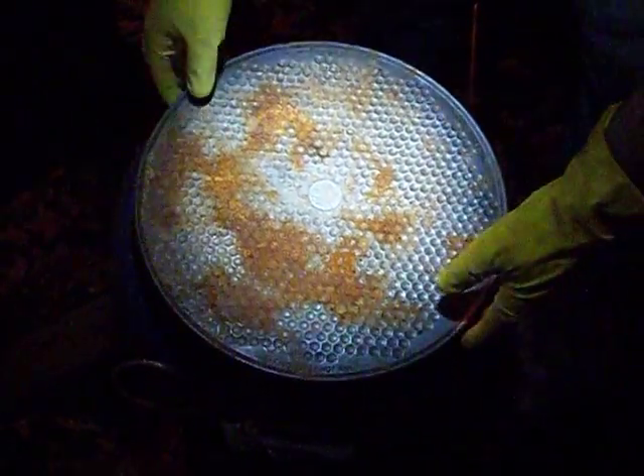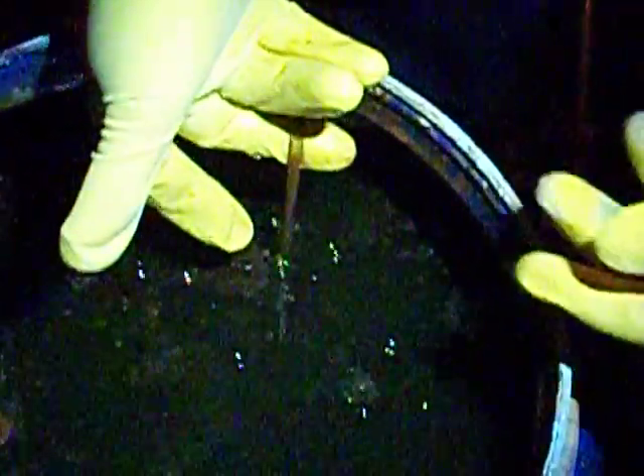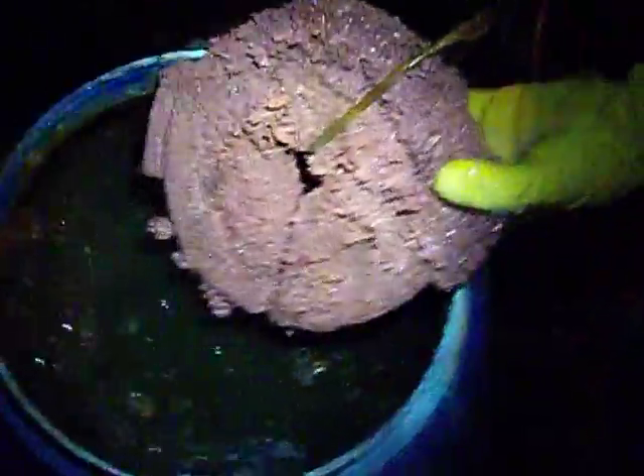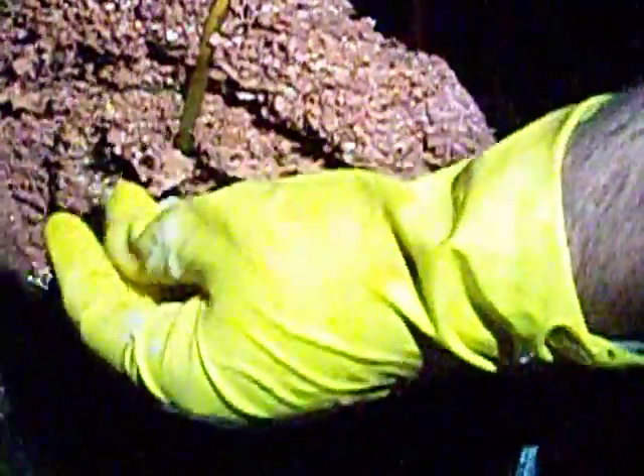This is one of my settling tanks — a small settling tank I use to cement the copper out of old AP solution. You'll notice the color of the liquid is still green tinted, but it doesn't have a lot of copper in it because I've got these pieces of tubing here I use to hang weights. These weights collect the copper — it's just an old barbell weight, steel — and it collects nice copper crystals that break off on their own and settle.